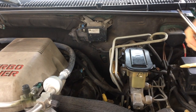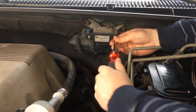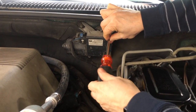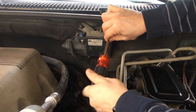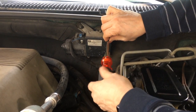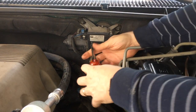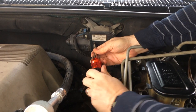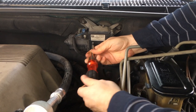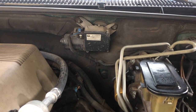I have a very simple repair for you today — it's not uncommon. I had the same problem happen on one of my other trucks about 15 years ago. What happened on this one — and I've been putting it off for a couple of months — is the intermittent wiper capability went wigged out and it also got to where it wouldn't turn off reliably. Last time this happened on the other truck, it was the circuit board inside the wiper motor, right under the hood, so that's what I'm going to try on this one.